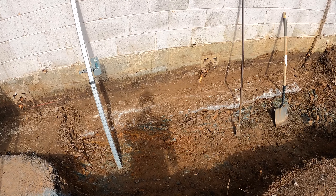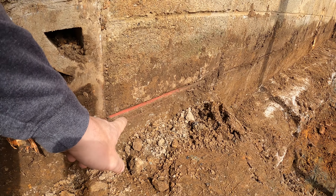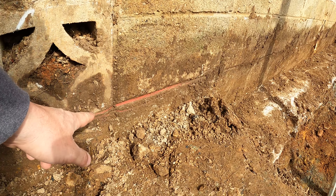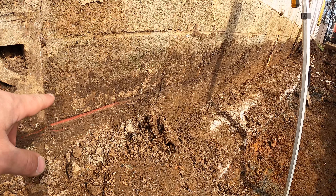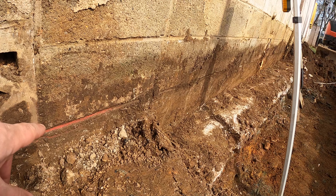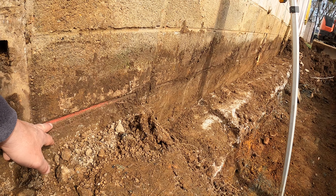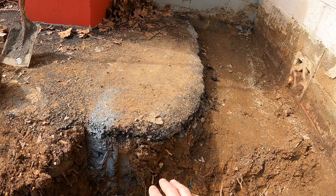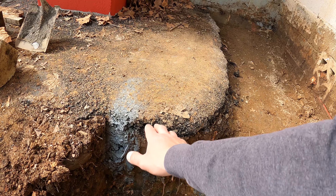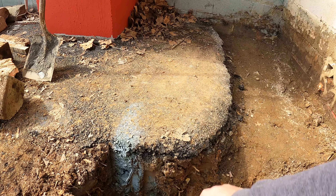You can see here, this is our footing. We measured all the grades and took all of our measurements, and this red line is actually going to be the top of the first course of block. Our block is 18 inches, we've got about an 8-inch base, so that gives us 26 — we're down 26 inches from that line into the trench. In this area, we're going to rip this asphalt out, and this course of block should line up with the concrete footing. The second course of block will just go right on to that footing.